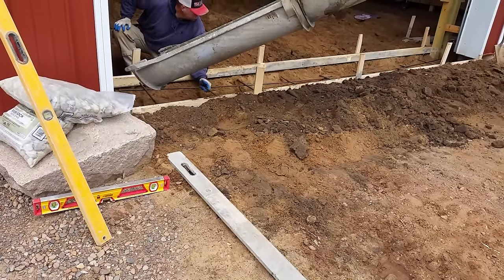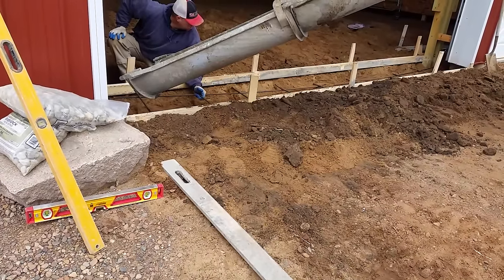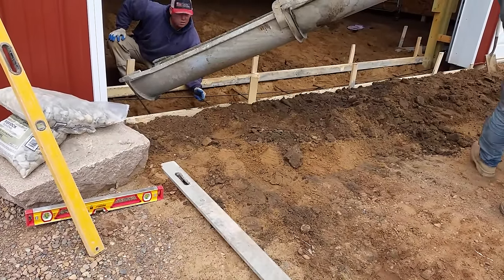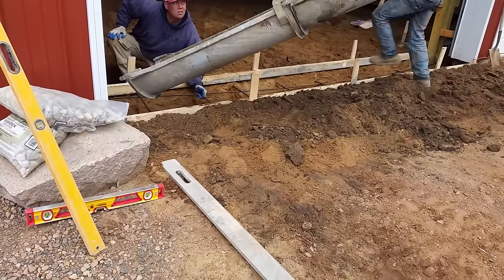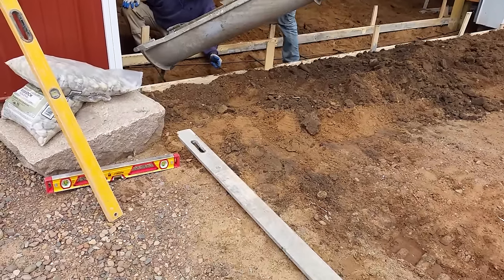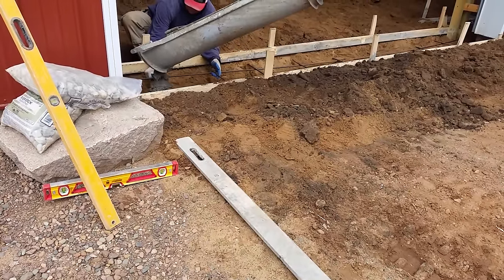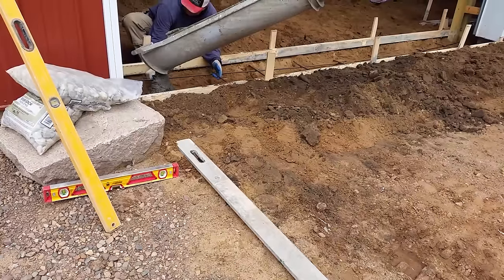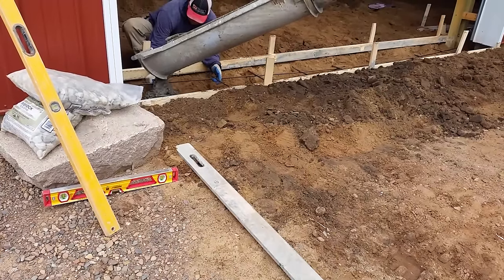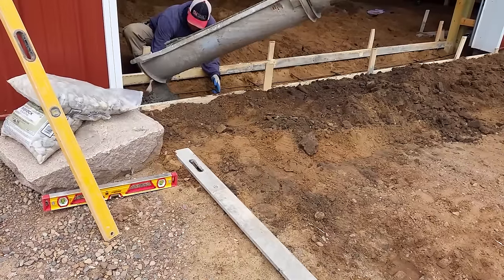This really set us up for winter. We're finally able to shut the door on the concrete and make the barn a little more airtight for the winter months. It's a great team to work with — Sean and his guys pour quick, pour fast, which is nice. We had to kind of lift the rebar up as you can see; it wanted to settle deep into the hole and we wanted it about midway, so we had to pick it up as we poured.